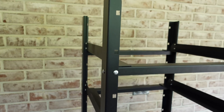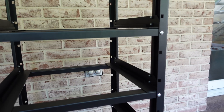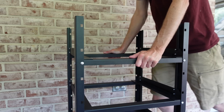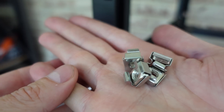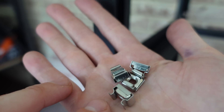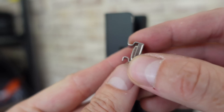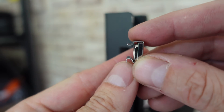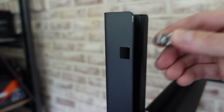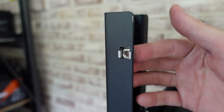This is actually a very heavy duty rack. I don't think the pictures they have online do it justice — it's very, very strong. It just doesn't wobble at all in either direction. Next I'm going to install these square nuts into the server rack, and these are what will hold the battery in place from sliding back out. On the front of the rack we have the rectangular shaped hole. We have this little clip on the side of the nut, and we're going to put it in with the clips horizontal and facing outward — those clips will hold that nut in from falling back out.